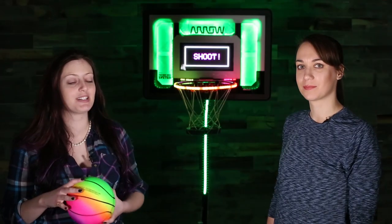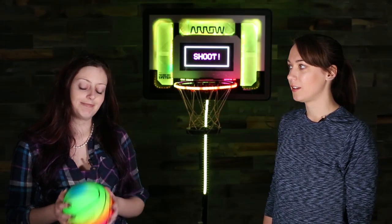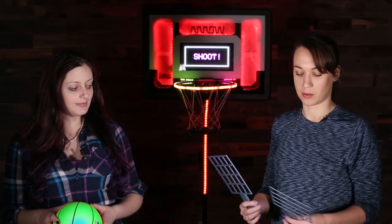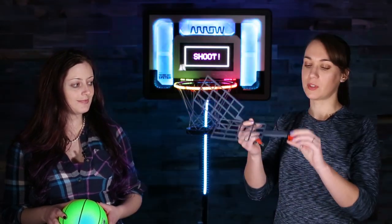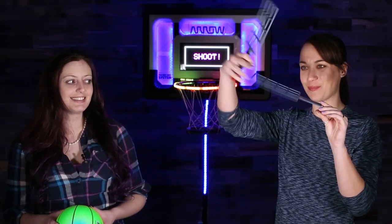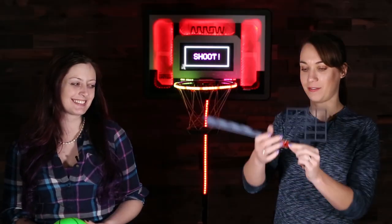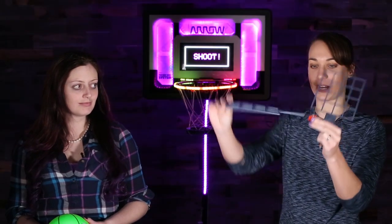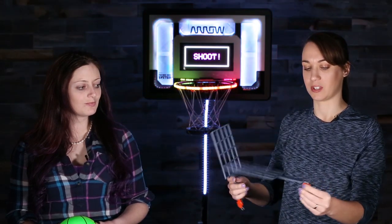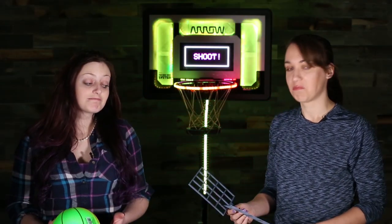The first challenge was actually getting the sensor to read consistently, not miss any, and not duplicate. We got a few different options. The first one we thought about was using a limit switch as opposed to an infrared sensor. So we 3D printed some little devices to actually capture when the ball would hit it — kind of like a fly swatter. Phase one was too heavy, so it needs to drop down and go back up. Phase two worked better, but as the ball would hit it, it would just bounce multiple times and basically give people like five points as opposed to one. So not ideal.